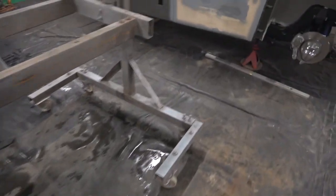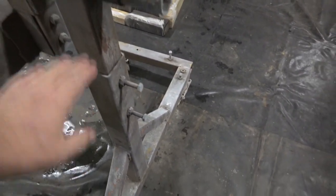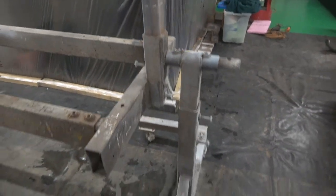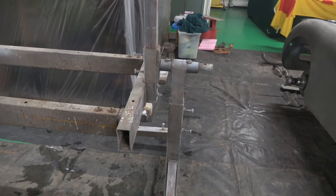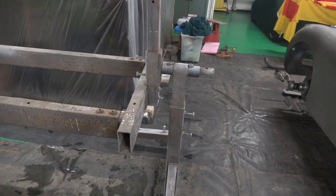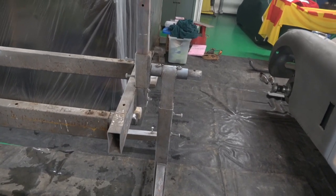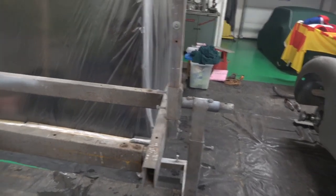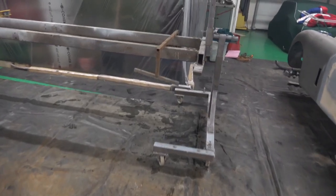The nice thing about this setup is that you can adjust it — this arm comes up so you can adjust it here, and you can also adjust it down here, so it goes up and down to get it exactly where you want the centre of balance. The problem with jigs is people think they should rotate easily, but for the amount of time you're actually rotating it's minimal. You tend to put it in one position and lock it off, so it's better to have it balanced so one person can do it.